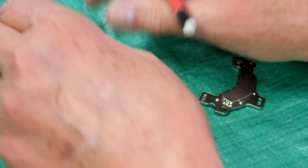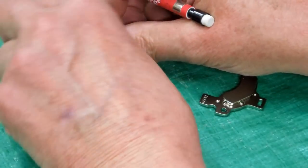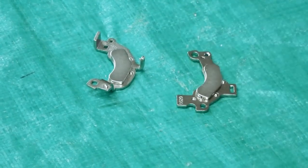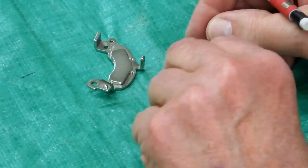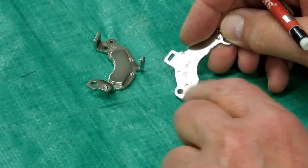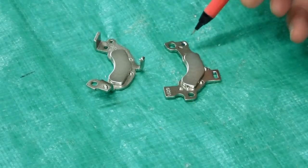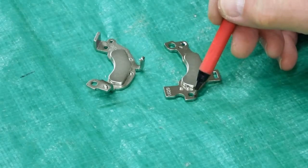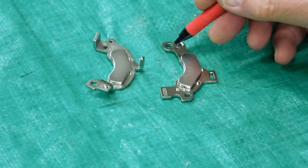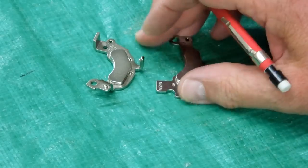This little bar that was on here — I just take a pair of pliers and bend that, it comes off real easy. Then you have two magnets. On the back side of one of them there are usually a couple of little bumps you have to grind off so that it will sit flat. If you need, you can drill these holes out a little bit bigger for a mounting hole. If any of these pieces get in the way, you can cut them off with a hacksaw.